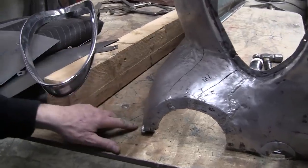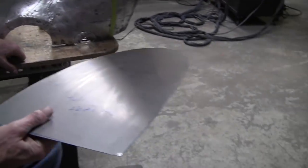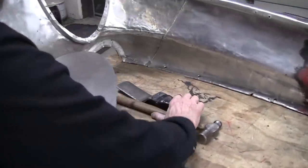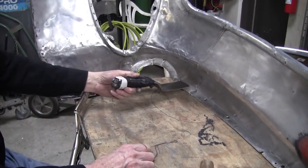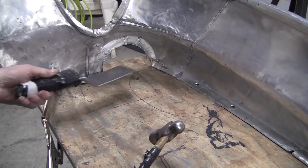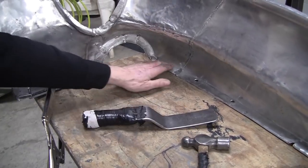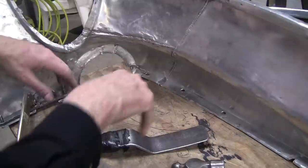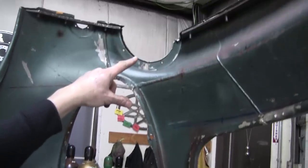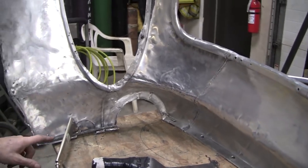This is short right over here still. What I'm thinking of doing is I'll take a piece of heavier metal, probably about half inch thick or so. I can use my slapper actually, and I'll put the piece of half-inch metal coming out like that and I'll have a block of wood under it because I can't get a hammer in here — so I've got to project the blow in. With the block of wood over here I can hammer like that, and that'll bring this edge — from here to here — down about three sixteenths of an inch or so. I still need to make that little pocket up there where the screw goes in for when you put the headlight bucket in. So it's coming.